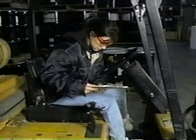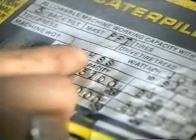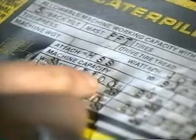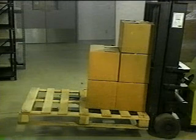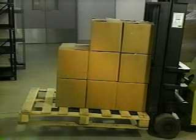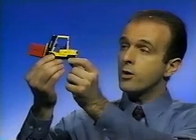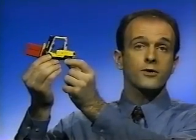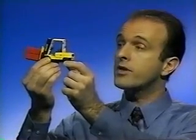One of the most important things to consider when operating a forklift is the amount of weight that you need to lift. Check your forklift's weight limits to see what it can safely handle. Remember, as the load's center of gravity extends further from the mast, the forklift's lifting capacity will be reduced. You may need a bigger vehicle with more weight in the back to correctly balance a load. When you're picking up an object, the balance of a forklift works like a seesaw — if there's not enough weight in the back, the forklift will tip forward.